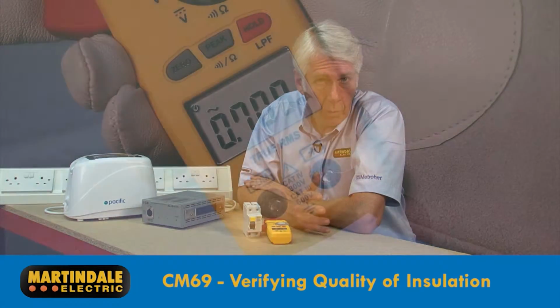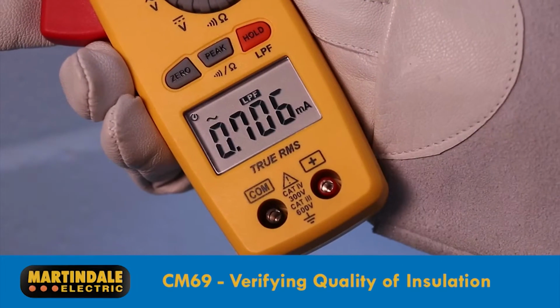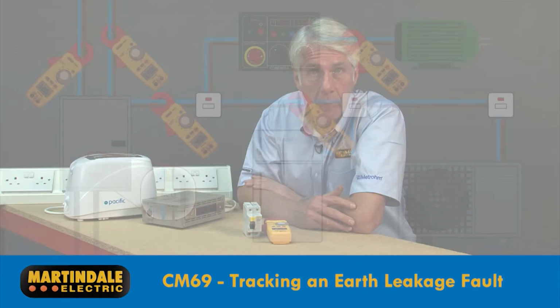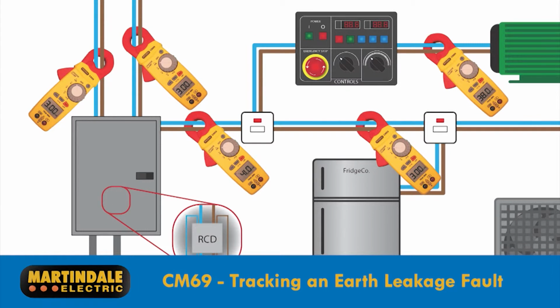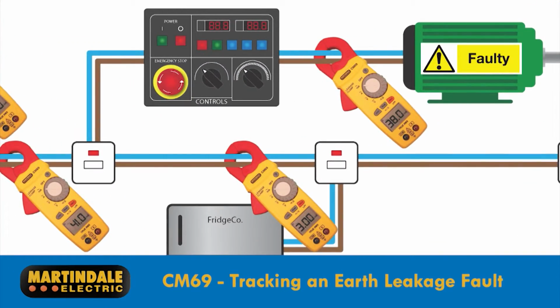In this application, when making periodic checks and comparing results, it's important to use the 50 Hz filter so that any changes seen are due to changes in the insulation resistance and not other variables like the level of harmonic currents flowing at the time. In this diagram, we can see how in industrial or commercial installations where single conductors are commonly used, it's easy to use this earth leakage test method as a way of tracking down insulation faults and monitoring deterioration of insulation in cables and equipment. We can see how each spur is investigated and how the testing route follows the path of the highest earth leakage reading.